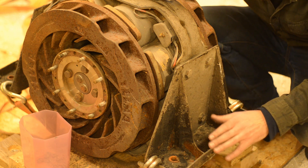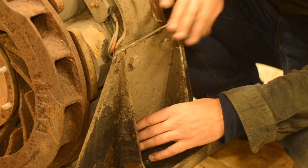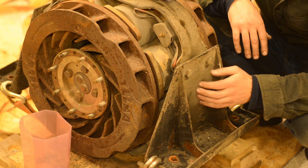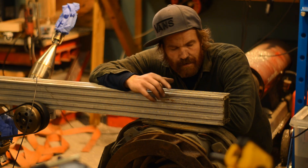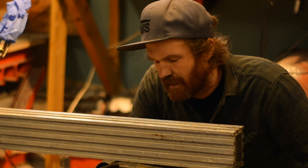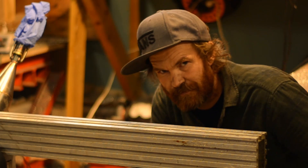I'm wondering if I should utilize the mounts from the truck — that was my original plan, which is why I bought those big bolts. Or I could unbolt this, use these four bolts only, mount those to the frame and then to the floor. Doing it that way means I could use the bolts on the other side for mounting the main frame beam, but it'll be around half as strong as using both sides. These mounts are meant to withstand 1,600 Newtons in the truck, and we're not going to see 1,600 Newtons.